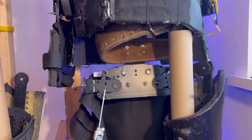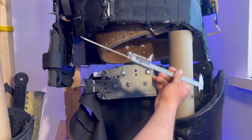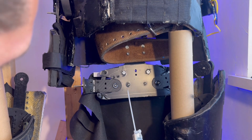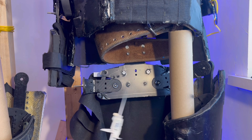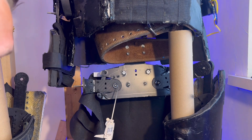The final major flaw was that this system wasn't a hundred percent load-bearing. All of the weight of the suit and in fact the user acts down upon all of the suit vertically, including on the hip joints. The problem for the hip joints is there is so much mobility required that everything has to be really tight to actually be load-bearing and designed in a certain way to make sure that at every angle at which you step you're always going to be on a load-bearing part.